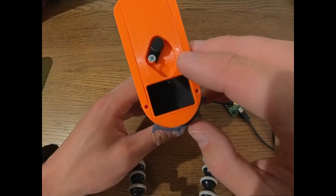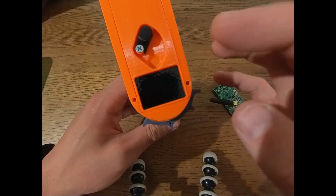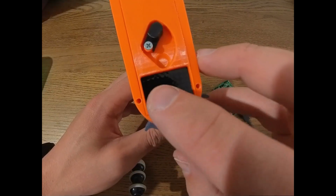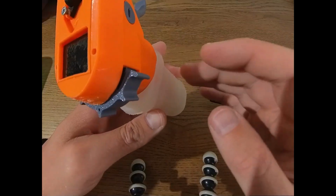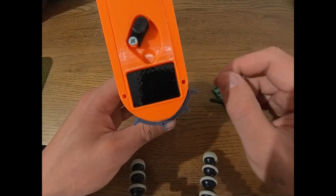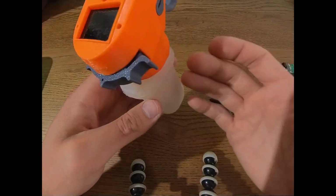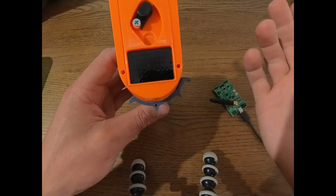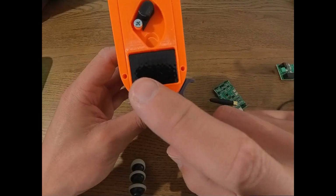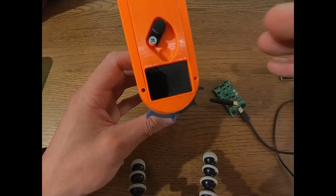One thing you're going to see is once we turn it on, it will first of all show us a boot. That means it's just booting up, measuring all its values. After that, it's going to show us VI, so internal voltage of the battery, and then a number, for example, 3.5 volts. That's just an indication for you how full my battery is. Now, this is just a normal lithium battery, so 3.5 is actually quite low. 3.8, 3.9 would be a medium, and then 4 to 4.2 volts would be basically fully charged.